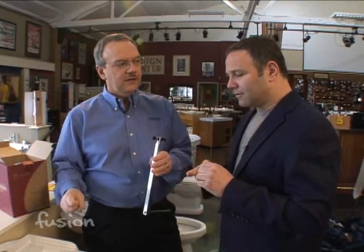And a good idea first, the most important thing is to know where to shut the water off in your house. Sure. And usually it's right underneath the sink. There are two little shutoffs, hot and cold. Shut those off, lefty-loosey, righty-tighty. So turn them to the right, shuts it off. And then you disconnect the supply tubes, which come up underneath the faucet. And there's usually a little nut underneath there. Righty-tighty, lefty-loosey. Okay, I remember this.